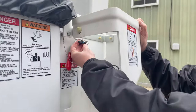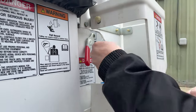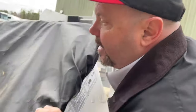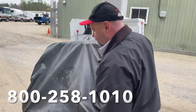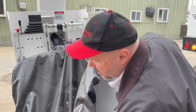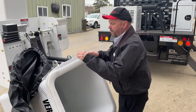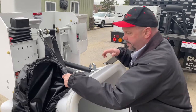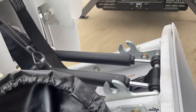It's done by releasing this pin — the blue button. You press on it, pull the pin out, and with the red handle you twist it, and the bucket becomes released. This is used for emergency purposes, rescuing personnel that may be trapped in the bucket. It's also used for emptying out water. It's got hydraulics on it to help put it back into position.